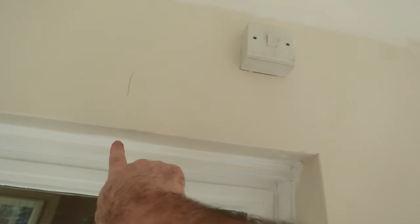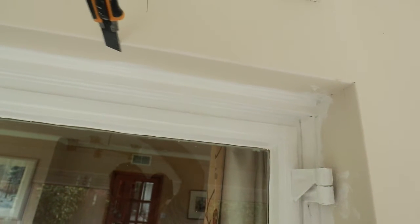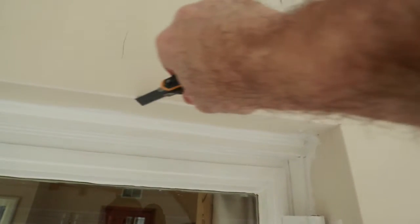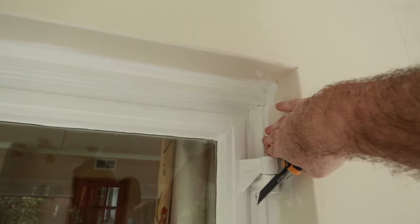But what I'll do, I'll drop this piece down top to bottom, and then because I don't want a joint going up there, I will neatly cut following, if I just get my blade out. Oh, I've not got my blade on. Got my tools here, sorry. Put them down. What I'll do, if that was a full piece of paper hanging all the way down, I'll get a blade and I'll make sure it's sharp and I will cut following that underside there. So that will give me a cut across there, and that's a bit rounded. So make sure you do it the furthest part. Don't do it on an angle there. Do it further round so it just nips across it. I will leave that blank and that'll be a filling piece. That will give me a flap of paper that I can just wrap round in one there.